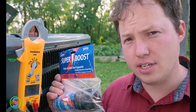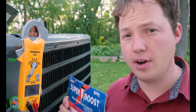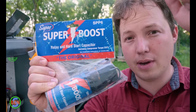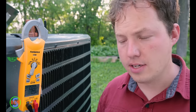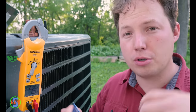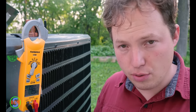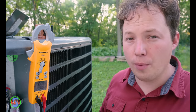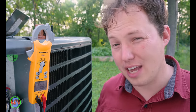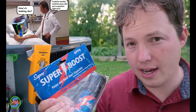This is specifically a last-ditch method to hopefully get your air conditioner or heat pump to go for a while longer. I will link to it in the description of this video. Sometimes older compressors begin to have more internal wear, where it takes more torque to get the compressor to start initially. It's not always the case that the compressor is imminently failing, but it most likely is. Usually if you use a hard start kit, you're going to get a little bit more time out of your air conditioner — sometimes quite a while though, so it just really depends.